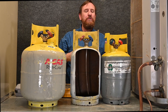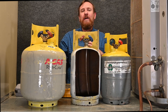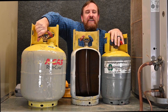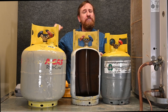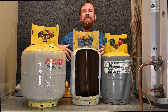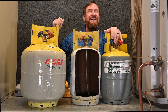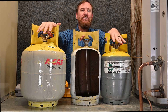Some more important things when transporting these tanks: make sure they're secure. These tanks are heavier than one-time-use tanks, so when they flop around in your service van they can cause more damage — they can break sensitive equipment like your meters, and that valve can be knocked loose. If a valve gets knocked loose, it's leaking refrigerant into your service van. Even with non-toxic refrigerant, displacing oxygen can cause you to pass out. If you hear anything hissing, immediately pull over, get the windows down, get out, open the doors, and find the leak for your safety.